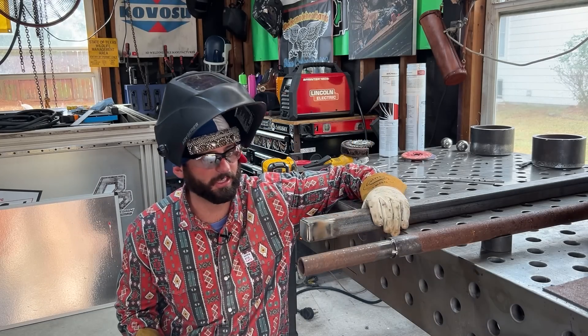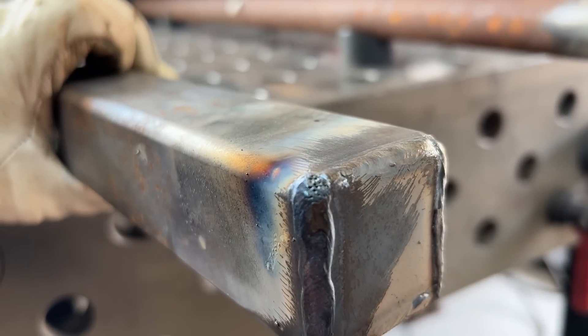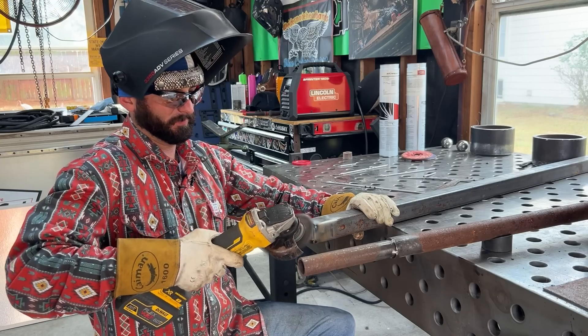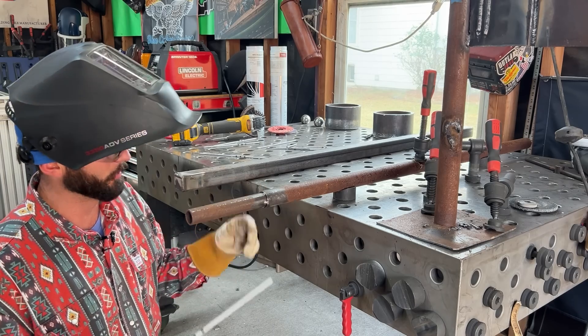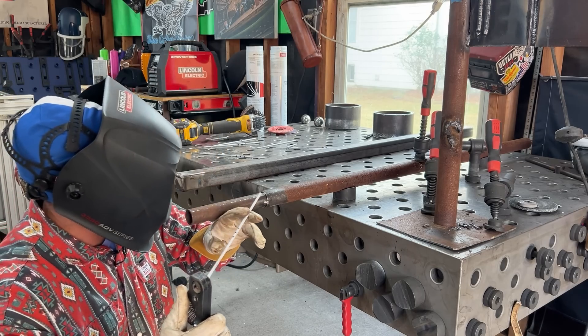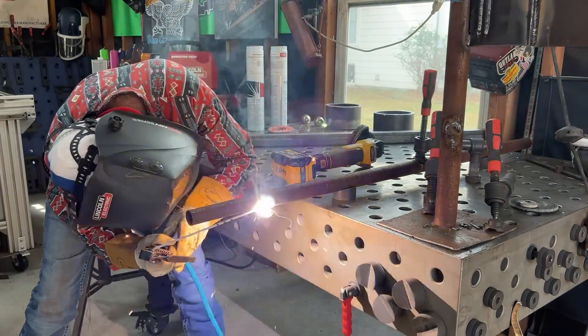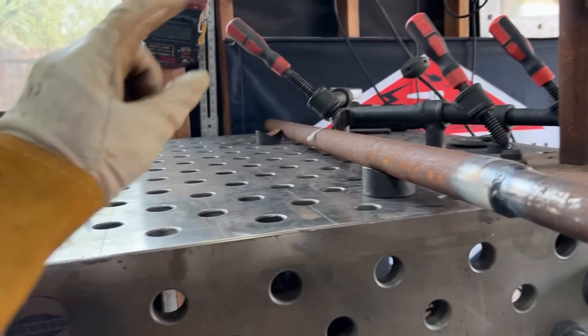Keep a really close arc length and it welds really well. The biggest trouble with welding downhill 7018 is the greater likelihood of catching incomplete fusion, porosity, or rolling over the slag. If you've got a piece of tubing stuck in position and can't roll it or reposition it, and trying to go uphill would burn a hole through it, then going downhill is a valid approach — that's the type of thing I'd do in the field on thin metals if I absolutely had to.